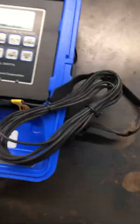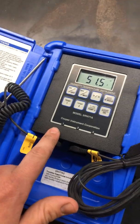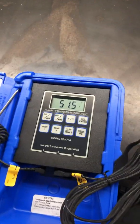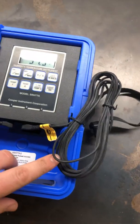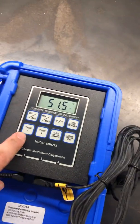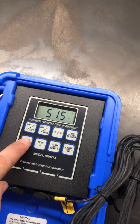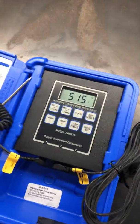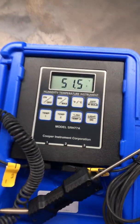Now let's imagine I had two pipe straps — one in port 1 and one in port 2. If I want to read subcool and superheat, imagine I had one pipe strap on the suction line and one on the liquid line. Pretty easy. I'm looking at my gauges: temp 1 — suction line, 50 degrees; liquid line, 51 degrees. Obviously our metering device is not working too well at that point, but that's an example. I'm in the HVAC world, so it's pretty easy to relate to terms like that.